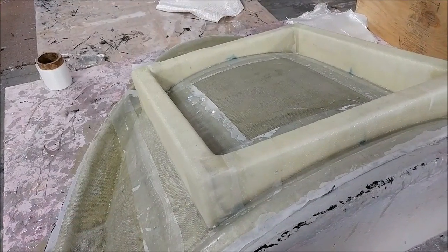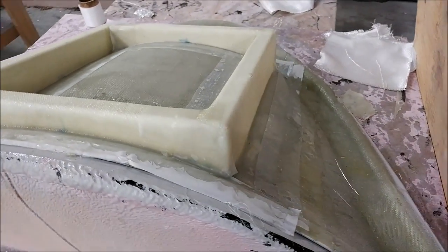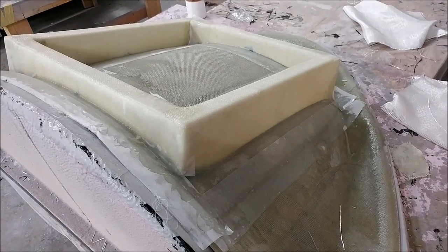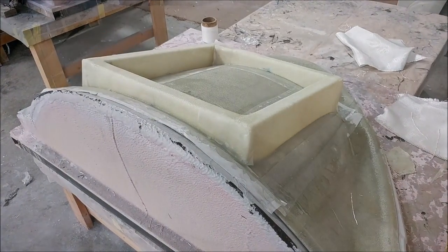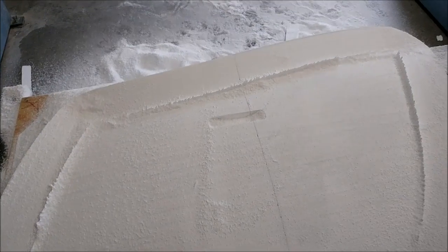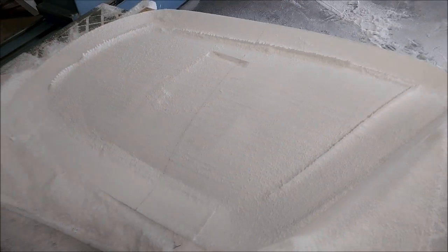Here is the nose compartment door mold with those foam brace pieces I was cutting — the guys got those glassed into place today, and that mold has already been released. Here's the left side one, now all complete; it just needs to be cleaned off. The little bits of extra foam where the flanges meet the actual skin just need to be knocked off — I don't bother trimming that during foam work, but I do on the putty.